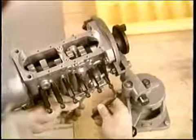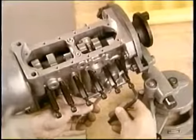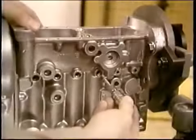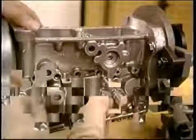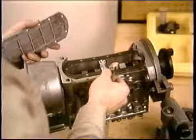With the drive hub installed to rotate the camshaft, you can remove each tappet holder without letting its tappet slam down onto the cam lobe. With all the holders removed, you can insert the plugs in the tappet holder openings. Fit the new gasket and attach the bottom cover.